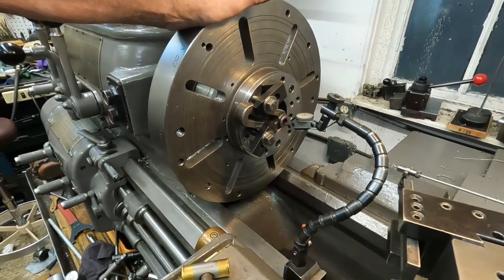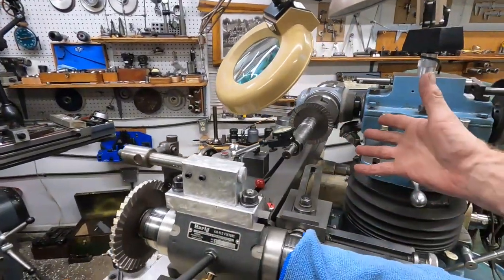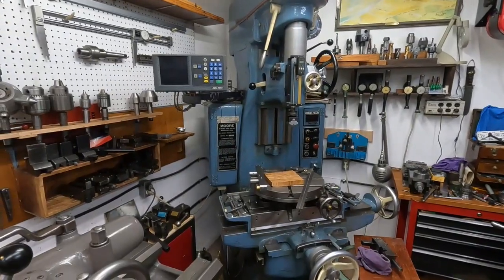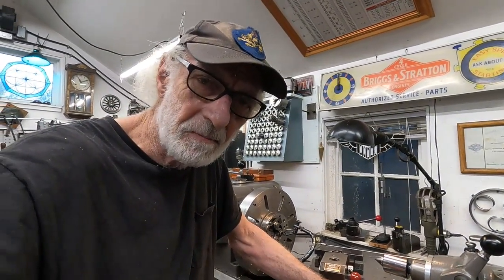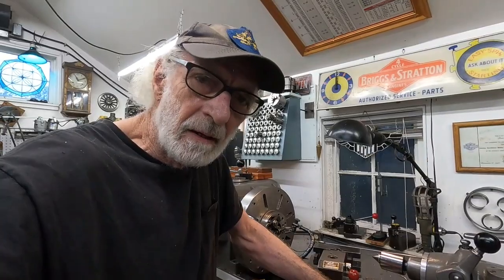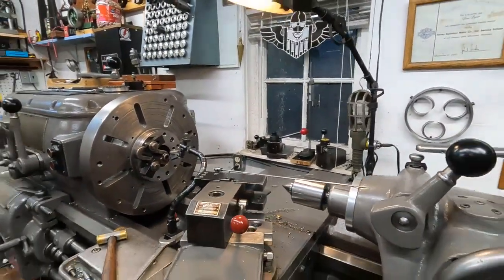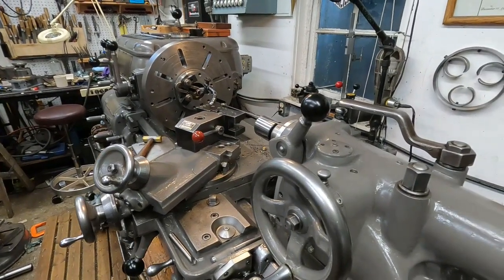And it's really nice to have this option, because this milling machine over here is tied up with this stuff, and it's a little bit too much of an elevated temperature to use a jig bore. And that's one thing I don't know about jig bores. I know they're not accurate above 68 degrees, but I don't know if it damages them operating above that. And I asked the guy about that, and he goes, well, why would you operate a jig bore above 68 degrees? Okay, so we settled that one. So it's really good to have this option here.